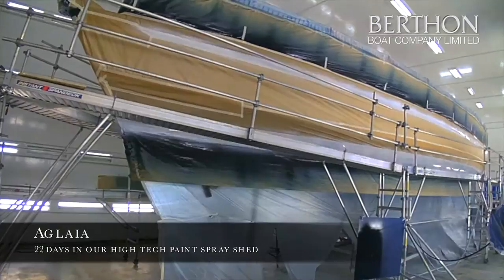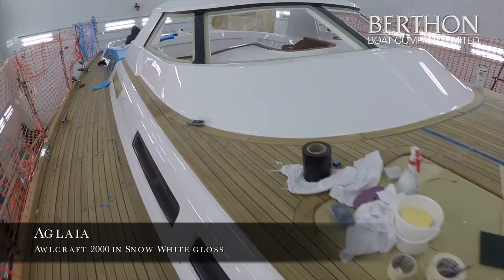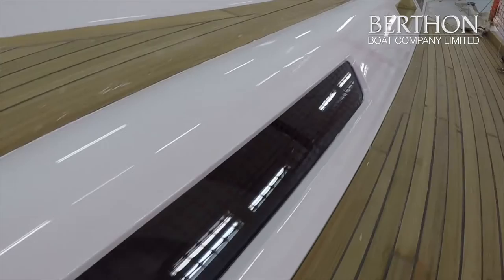The vessel was in the preparation booths for the sanding and fairing and then we moved it into the custom climate spray booth. We were controlling the humidity, the temperature and also the pressure in there so that when the sprayers went in we got the absolute best quality paint finish. It also meant that we could get an off-the-gun finish and we didn't have to polish, which is a very difficult thing to do but that's what our paint shed allows us to do. It also makes sure that the paint runs properly to minimise orange peel effect and that the paint cures properly and gets the best finish.